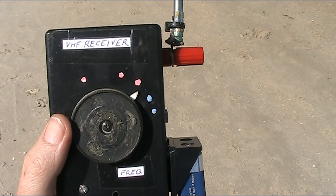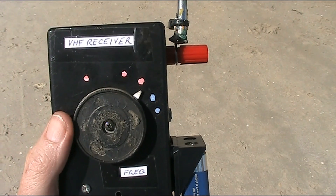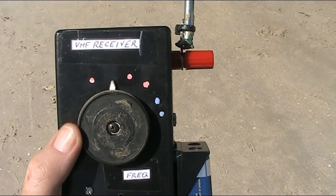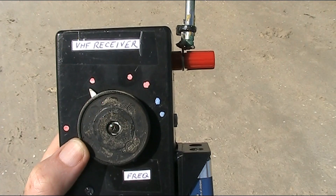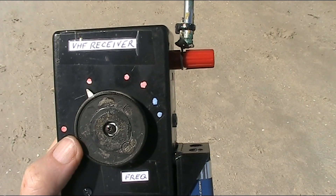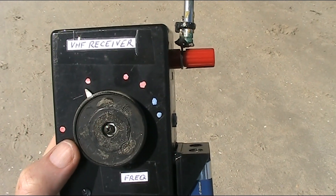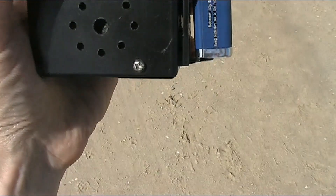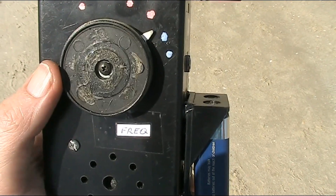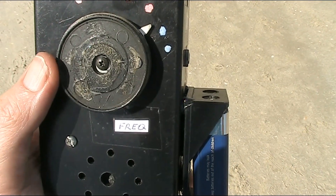If you're not familiar with this receiver, I've described it in a previous video. It's very simple — uses a super regenerative circuit, one transistor with a LM386 audio amplifier, which drives the speaker quite comfortably. It's not selective, so you'll sometimes hear multiple signals.